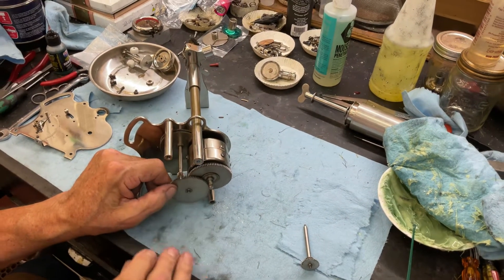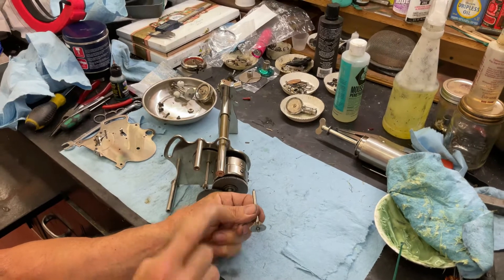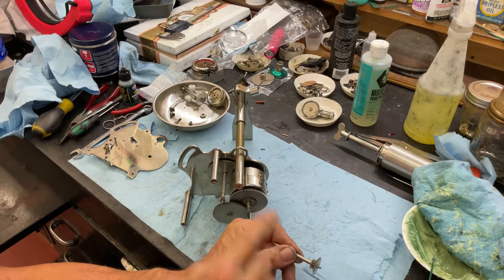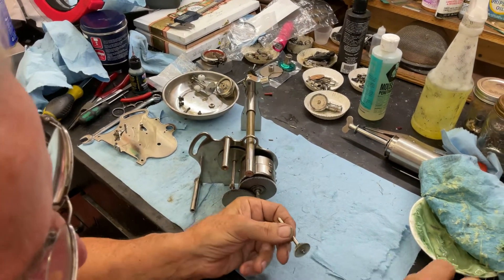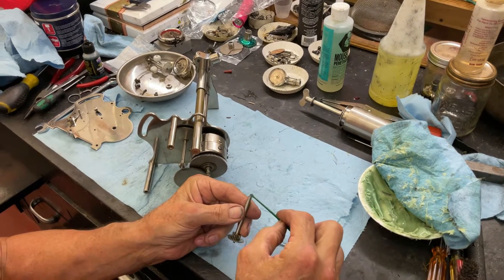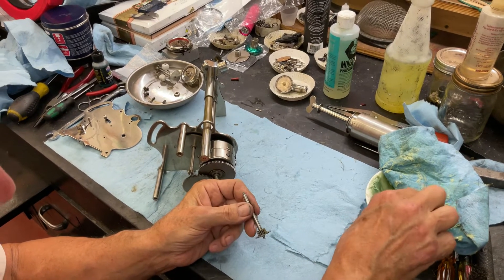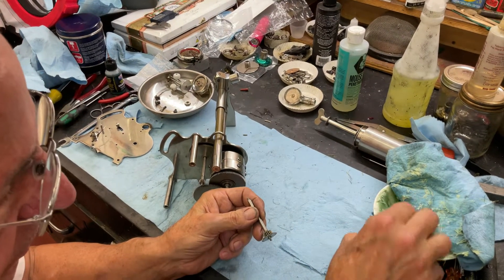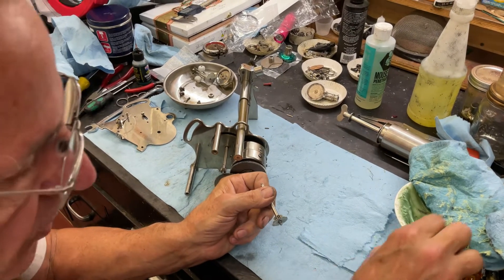See how all the gear train hooks up? Now this is the hard one, because this gear here drives off the spring barrel and this gear here runs your lead screw that's all under here hidden. I do put just a little grease around the gear for safety.